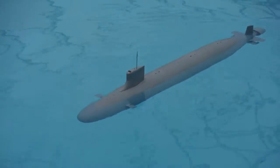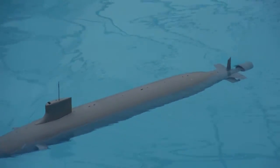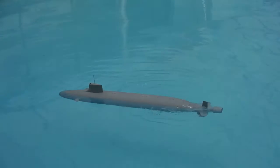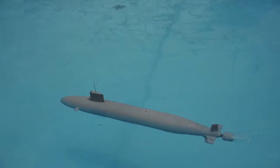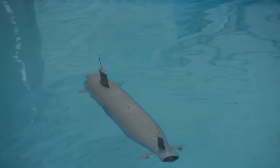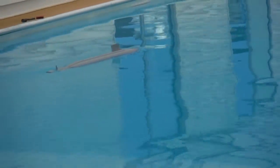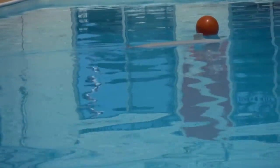I'm going to do a couple of maneuvers on the surface. As you can see, the majority of the upper rudder is in the air where it does us no good at all. As a consequence, our turning radius is off, so it compels me to do these Y-turns — shift my rudder, going ahead, and back off on the throttle so I stop sucking air, which is a big problem with the pump jet. This thing hardly turns at all. So I'm going to abandon running on the surface and get that other rudder under the water.